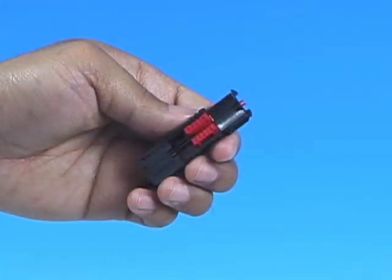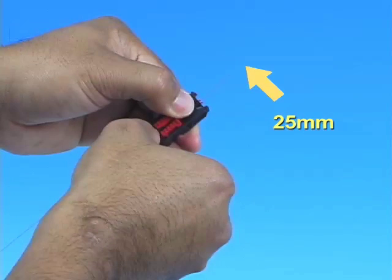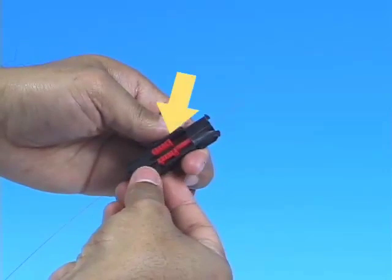Inspect the 250 micron fiber holder and ensure the grooves are free of dust. Ensure that the fiber holder clamp is in the open position by sliding the clamp forward in the fiber holder. This is evidenced by the small red tabs protruding from the end of the fiber holder. Insert the cleaved fiber into the center groove with a total of 25 millimeters of fiber protruding from the end of the fiber holder as shown. Close the fiber clamp and anchor the fiber in place by sliding the fiber clamp holder to the closed position.